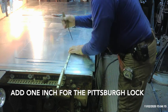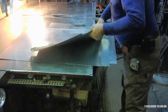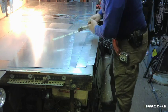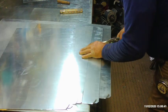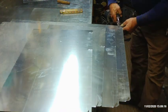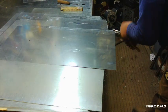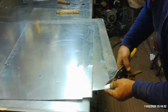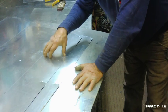To get the 9-inch duct dimension, we have to lay out 10 inches from the end. Go back and pick up your 10-inch mark in from the outside edge, then go back and pick up your 9-inch mark. Now we have two sets of duct — 18-inch long and 36-inch long, 9 by 20 — ready to cross-break and run through the lock former.